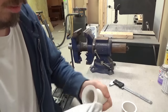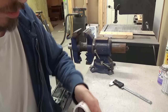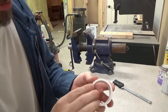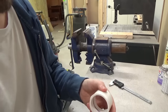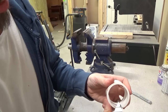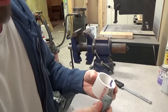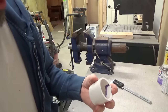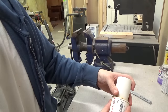Get all the residual dust off of there. You may have to clean up some of the edges with a razor blade — sometimes the sandpaper melts the PVC a little bit and it curls over. You can just take a knife and clean that up. Go around them and clean up the edges if needed, then verify your edges are looking good.